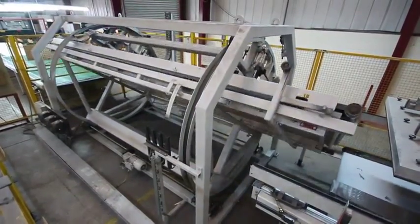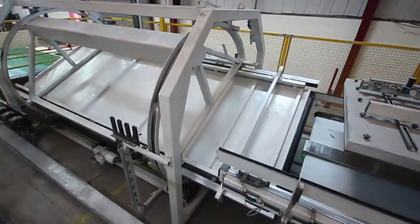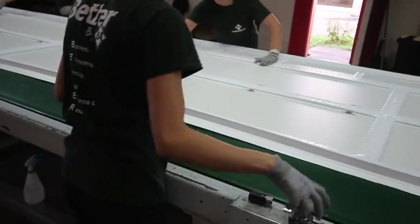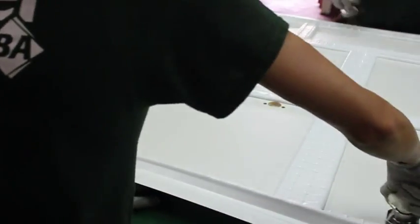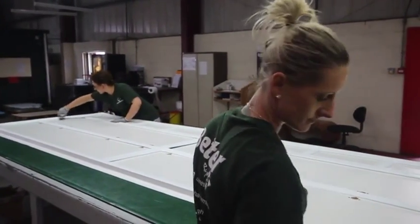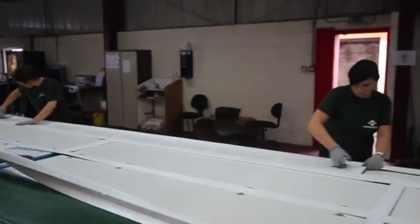The full press of doors now needs to be turned over, ready for cut out into individual pieces. Every door is cut out individually by hand before being given a final inspection. Each inspector stamps their own unique reference code in the hinge hole, so we can throughout the life of the door have full traceability back to the batch, the press line, and the individual who passed the door.